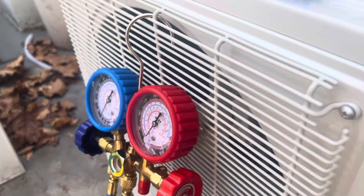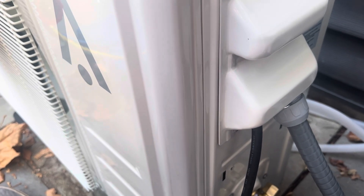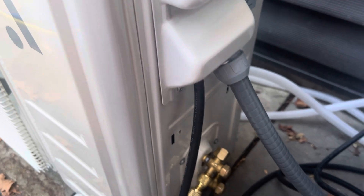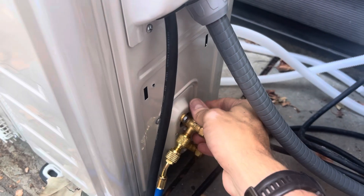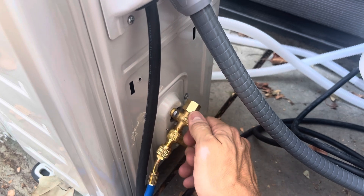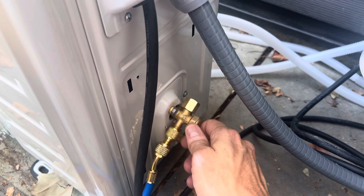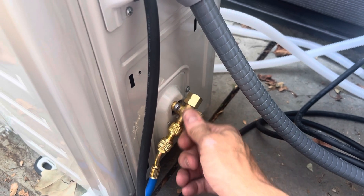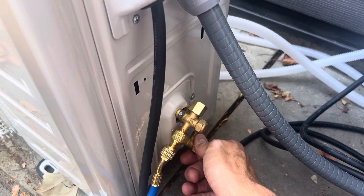I don't know what's going on here because I've got this mini split I'm working on and I can't get it to hold a vacuum for the life of me. I have had this thing with lines completely set all the way to the inside. I've checked the flares, I've reflared it, I've checked the settings on torque, everything's been right and it just won't hold a vacuum at all.